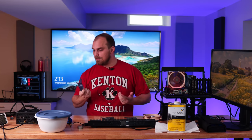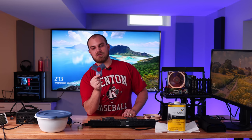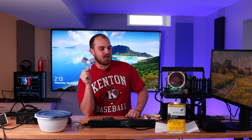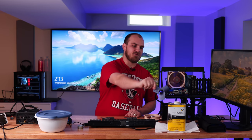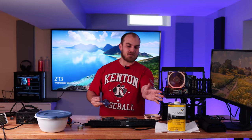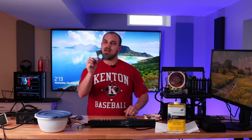But the reason that I don't smooth out my prints for the fan showdown videos is because, well, I print all my fans out of PLA. And really, when you put PLA in an acetone vapor bath, nothing happens. And to understand why PLA doesn't react with acetone, we first got to understand why ABS does.